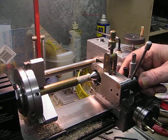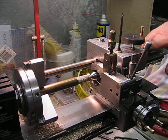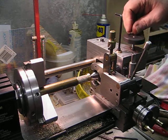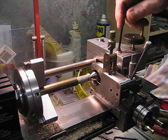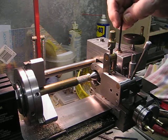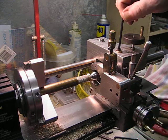I'm at the stage now where I've made the split clamp that clamps partially around the bottom and top of the quill, and it works very well. You move it up and down, it runs fine, and then you just give it a little nip and everything's locked up. I put a spring in between the two halves so the spring helps to separate them when you undo it.